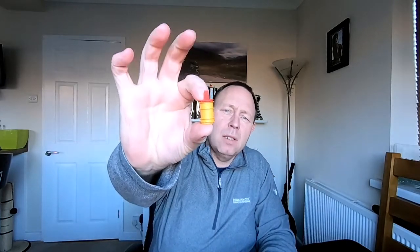When to use them and how best to use them. It's likely when you got your kit for this meter that you also got an accessories box as well. In that accessories box there's a couple of spanners, maybe a little depth gauge, and some sleeves that are used for measuring ERH or equilibrium relative humidity in concrete.